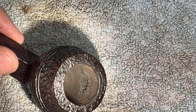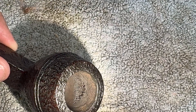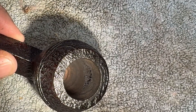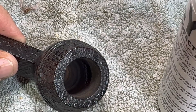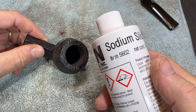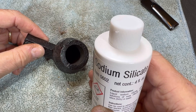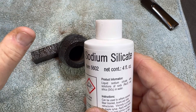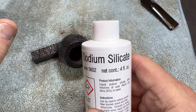Typically you'd see me use some pipe mortar and just fill in those areas, but I wanted to try something a little different. It's a different product and it will be extremely hard, extremely durable, and should be a lasting repair. That is using sodium silicate — some people refer to it as water glass — and we're going to mix some of this up with some powdered activated charcoal for color. Once it's fixed, supposedly you don't have to ever worry about it again.